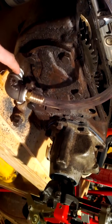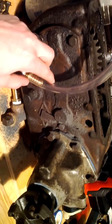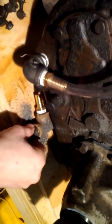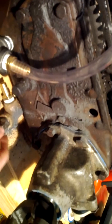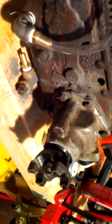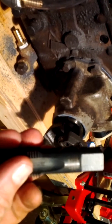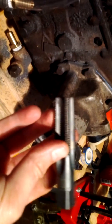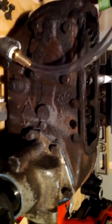I'm using galvanized pipe threaded on both sides, going to a 90-degree fitting, then to a brass barbed hose nipple. I'm going to wrap it around to this T right here. I'll put a half by 14 NPT tap and tap this hole, and that T is going to end up being my fill hole.